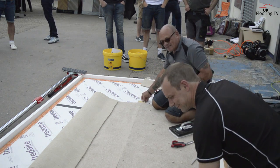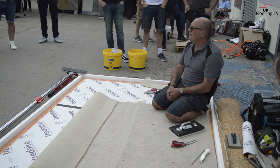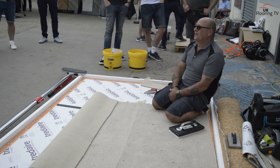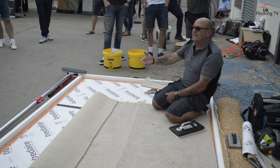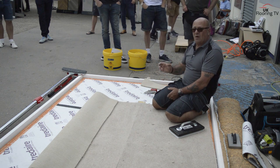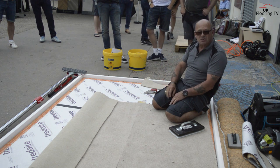Is that hot enough yet? The heat seam iron should be set between two and three - all thermostats are completely different, really it's trial and error. You shouldn't have it any more than three. You'll think you'll get it done quicker on four or five, but all that does is burn the resins and you get a brittle joint that will just break up. The lower you can have it, the better. Also, you won't get heat transfer coming up through into the pile. All piles are heat-set with the twist in the pile direction - if you're working against the pile you could actually reset it at a slightly different angle and end up with a light or dark line going down that joint. You have a perfect joint but you've got this three-inch line all the way down - or it can open up and relax that twist in the yarn and it looks a slightly different colour, and that joint just becomes visible.